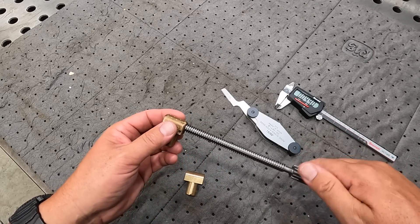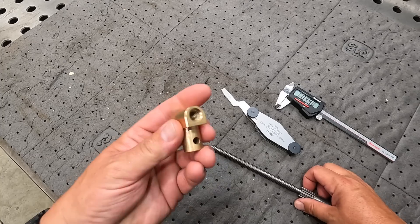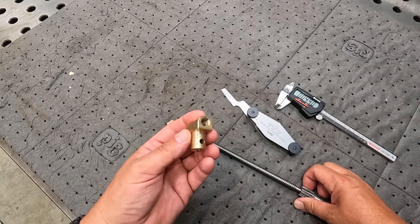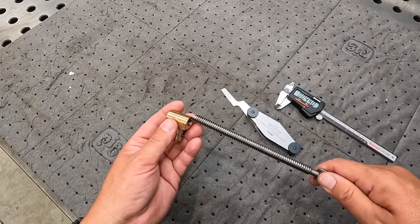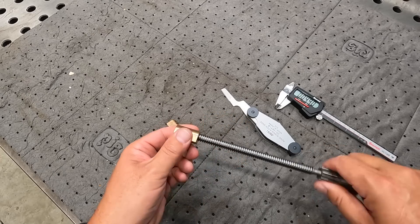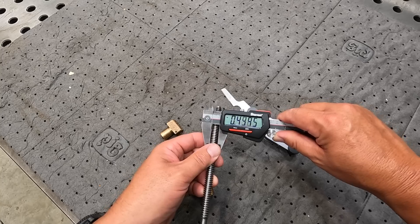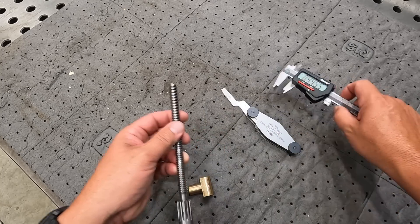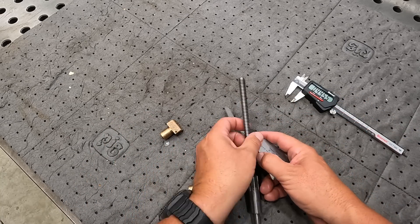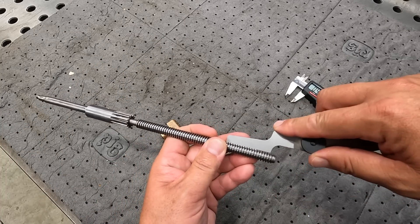What he's asking me to do is find out why the new nut — this guy right here that he purchased — the lead screw will not fit inside. Absolutely will not go in there. I measured it and this is a 7/16" diameter lead screw, 10 threads per inch. Here we have our pitch gauge and it lines up — so 10 threads per inch, lines up beautifully.